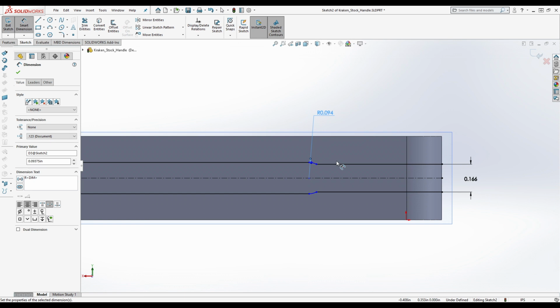I believe the main difference between V1s and V2s insofar as their machining is that the V1 was cut using, I'm not really sure of the terms here, but the piece was held sideways on the back of the channel and a drill would drop in and cut all the way up to the pivot area. Whereas on the V2s and V2.5s, it's held sideways on the face of the handle, and a T-slot cutter is used instead. Right. So a T-slot cutter did not do what I'm looking at right now. It did not. Right. So a mill was used to do this.